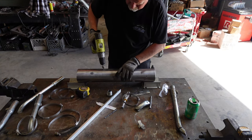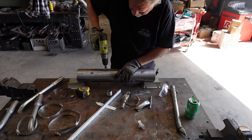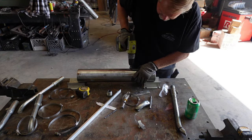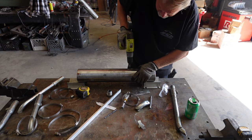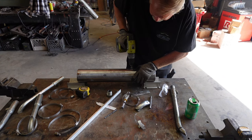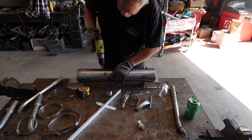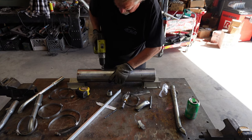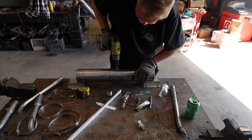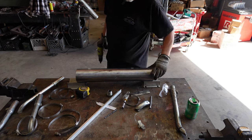Just a little countersink, just to help flow. It's not any sort of real flow thing, but if you don't put a little countersink on them, they have a tendency to whistle pretty loud. Not really a performance thing that we've seen. They can just whistle and make you think something's wrong with the truck or the shock when there's really not. And that's countersink.